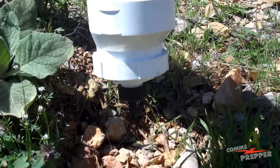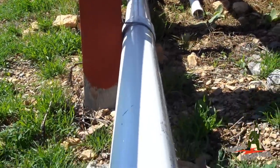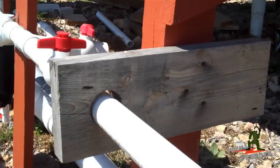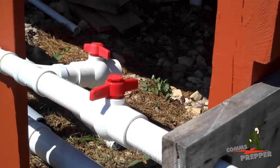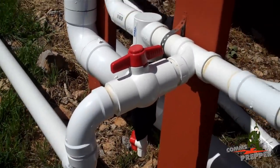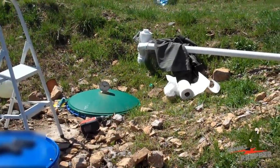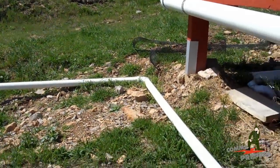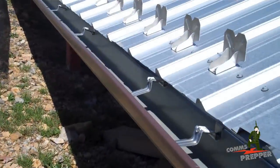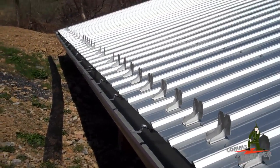The drip valve is installed. This is the first flush or first wash chamber — let the water back up so the drip can rinse. We've adjusted our valves here: we've closed the two going to the neighbors and to the other tank, and opened up this valve. So the next rain, water should come in, go through the filter, come into this pipe, go across there, down into the tank, and my level should rise. Now we're going to loosen these screws and get this leaf guard put in correctly — without cutting my hands all up like I've already done.